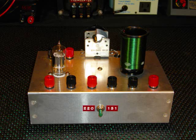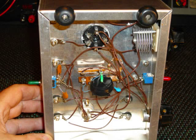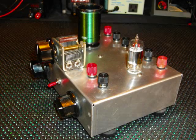I have four different antenna coils for reception of different bands. The bottom view shows an interesting design feature: a homebrew RF choke seen in the center of the picture and wrapped in black electrical tape. It's wound using number 33 magnet wire on a metal sewing bobbin.